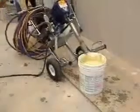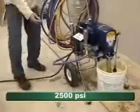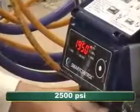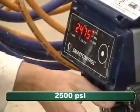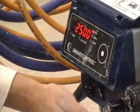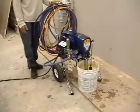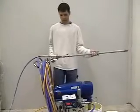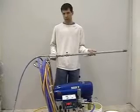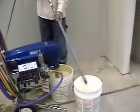Once you have mixed up the taping or coating compound, set the Mark V to 2500 psi. The higher you set the pump pressure, the faster the pump will deliver material when the trigger is pulled. Beware, higher pump pressure will also make the start more difficult to control depending upon compound consistency. Connect the taper or finishing pole onto the inline valve depending on your current process. Pull the inline lever to advance the material and prime the lines with compound.